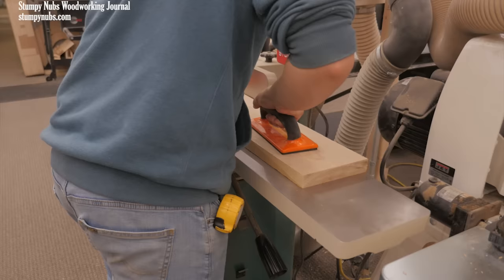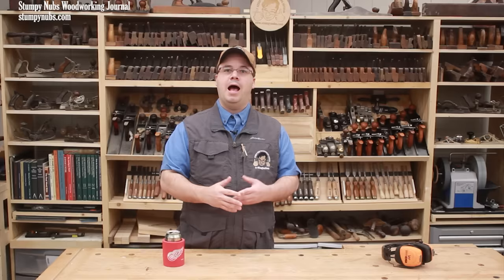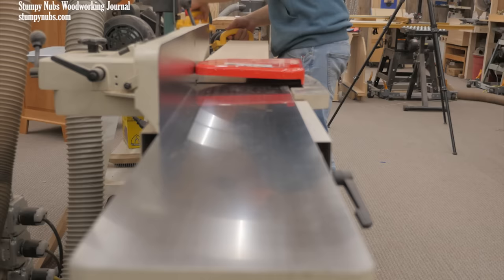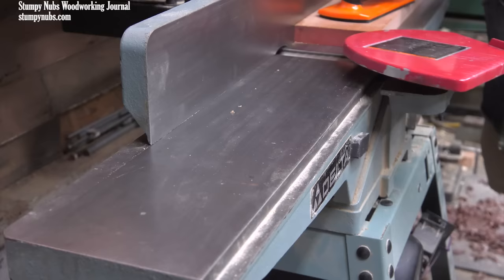To flatten the surface of a board, you begin on the infeed side on the right and move the board left across the cutter head onto the outfeed table. The depth of the cut is controlled by the position of the infeed table — lower for a deeper cut, higher for a shallower cut. How deep you may cut in a single pass depends on the power of the machine, the width of your board, and the hardness of the wood. I almost never take more than an eighth of an inch off a board with a single pass. With a lower power jointer I may reduce that to a sixteenth of an inch or even less, especially when using the full width of the cutter head.